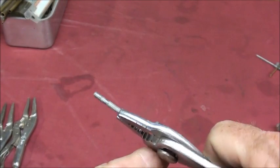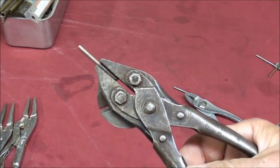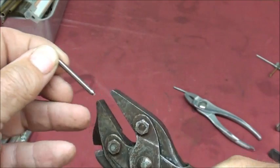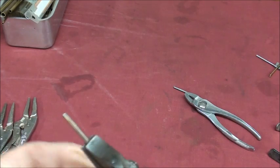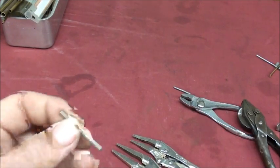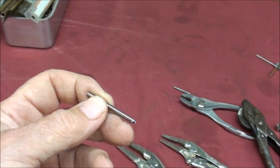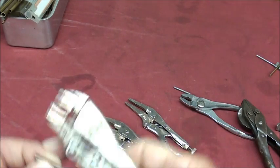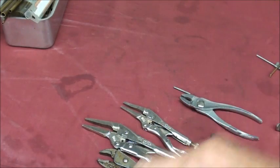When you go to grind small pieces and want to hold it in a plier, don't even think of this type of pliers - even though it's a Proto, it's going to move all around and is absolutely worthless. Use your Bernard parallel jaw pliers. You may know them as a Channellock, but the jaws remain parallel, and there's even a little V-groove to help you hold small work. You can get a pretty good grip on that, although there's still going to be some vibration. For real secure work, you can also hold in vise grips. I've got several different sizes - I like these needle-nose ones, genuine vise grip brand, not some generic thing. Vise grips will work good, but they do put a mark on the work. That's why I tend to like the Bernard and some of the other tools I just showed you.